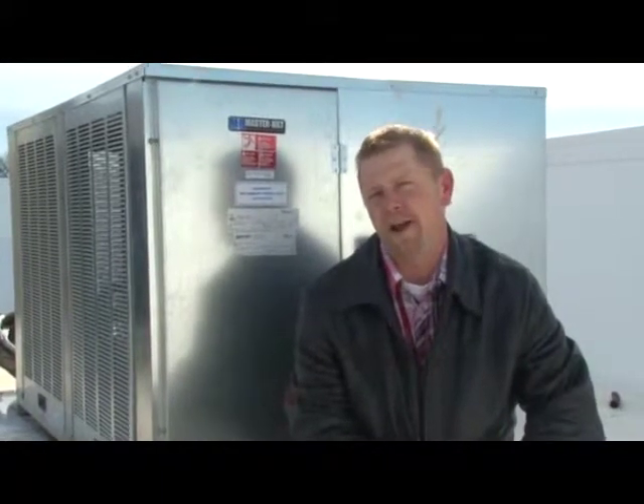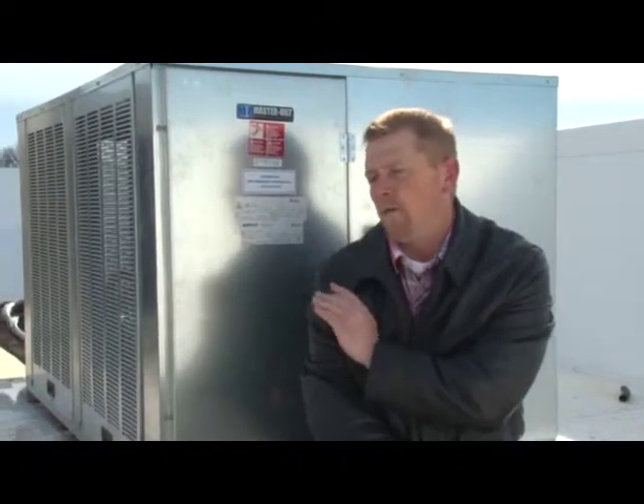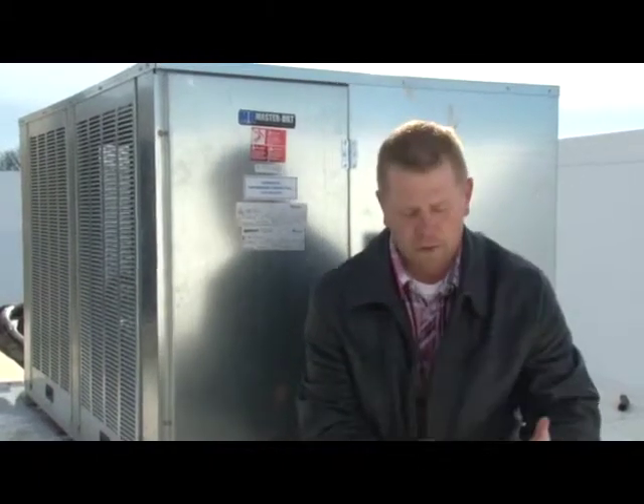Here we are back up top. We did have to add a little bit more refrigerant to the freezer — we've got a total of eight pounds in it now, and it is running just as it should. We have a total of three pounds in the cooler, which is a fraction of the amount of a traditional mechanical system. A couple of things to point out again when installing and starting up these systems: the refrigerant amount will be very, very minimal compared to a traditional system. The liquid line has to be upsized one size to accommodate the reverse cycle defrost. The low pressure control must be set using a gauge — the cutout should be between 3 and 5 PSI and the cut-in should be between 20 and 24 PSI.